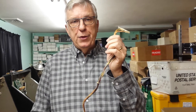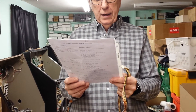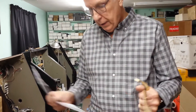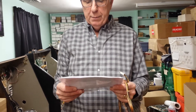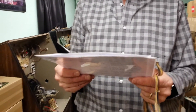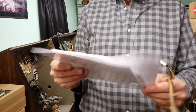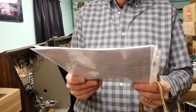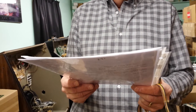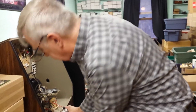Again, errors 37, 38, and 39. If you go to your service manual and look at your troubleshooting chart, it's going to say that transfer starts and runs continuously — that's what it says for those error codes. It's the same description for 37, 38, and 39. The troubleshooting chart will tell you the probable causes: the MEC control board, the wiring to the motor, the central control computer, the MEC board, or the wiring from the central control computer to the MEC board. I'm telling you that the problem is 50% of the time it's not in the boards — it's in the harness.